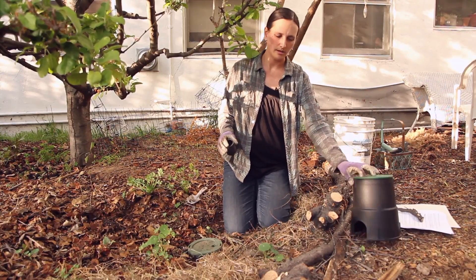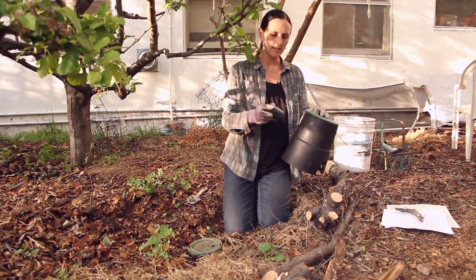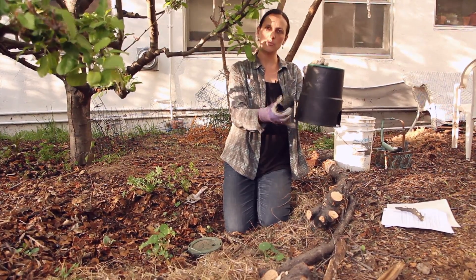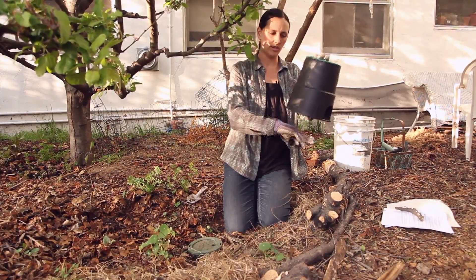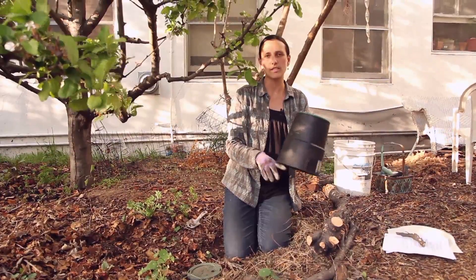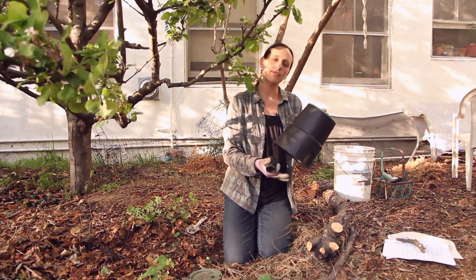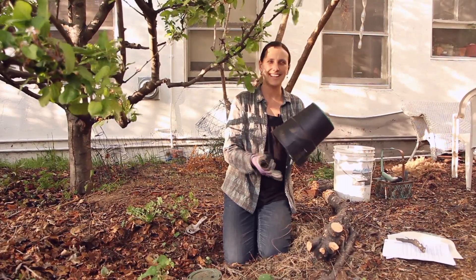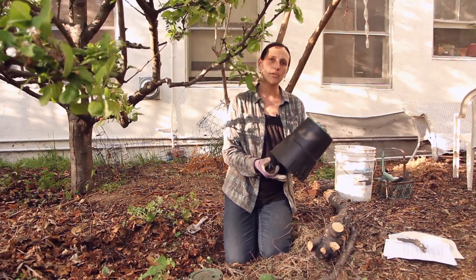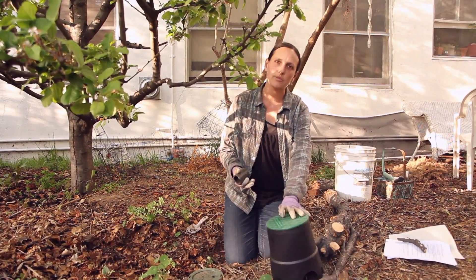So I'm going to look for two things. I am looking for the greywater outlet, which is coming out a piece of pipe like this. It's coming into my mulch shield somewhere along the line. There should be a big air space between where the greywater comes out and where it lands into the woodchips. That prevents roots from going back up into the greywater system. I'm also looking for actual woodchips on the bottom, because that is the filter. It catches the lint, or it catches the food particles and the grease, and that will eventually decompose, and after it's decomposed, it doesn't infiltrate water as quickly. So we need to replace it.